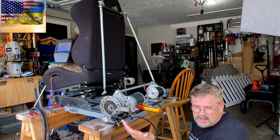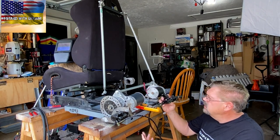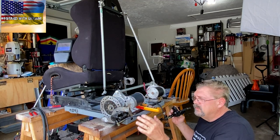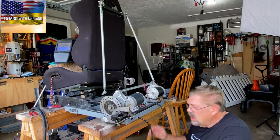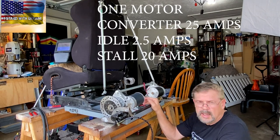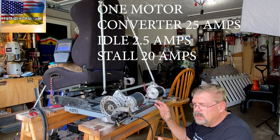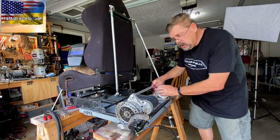I'm doing this so that you don't have to. I bought this little hydraulic assembly — it actually has a hydraulic reservoir pushing the piston, and it does stop the motor. I needed to see just how much amperage it would take to stall this thing out, and we know it's right about the limit of this converter. This is a 25 amp supply — it'll go a little bit higher, but we don't want the supply kicking in and out. So until we get both motors running and get a better idea, we may have to buy two of these converters.